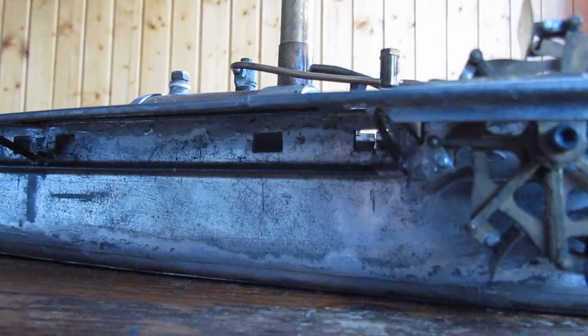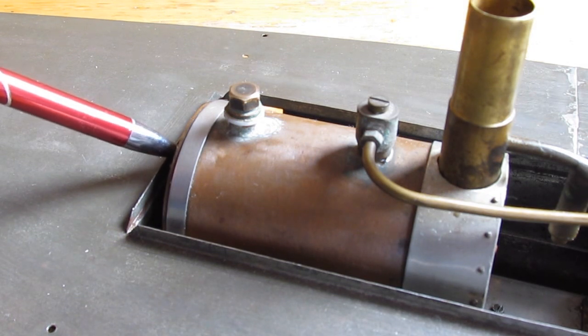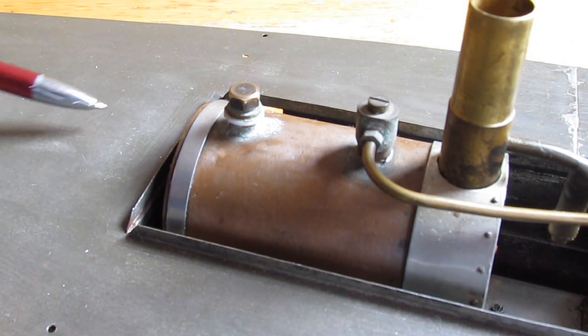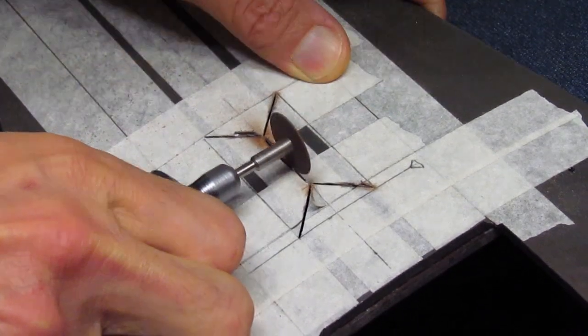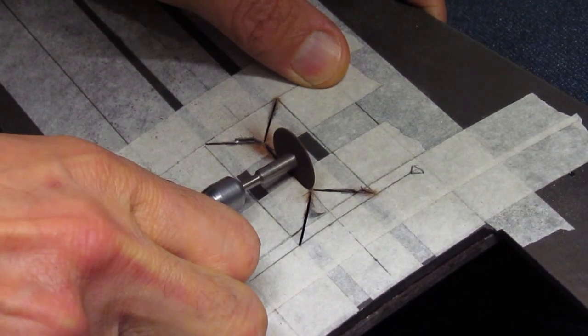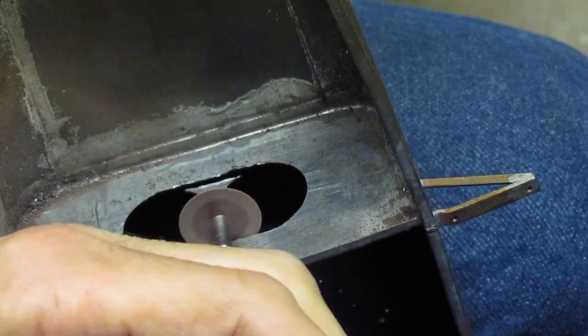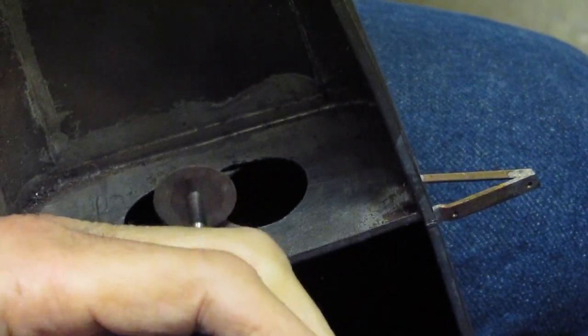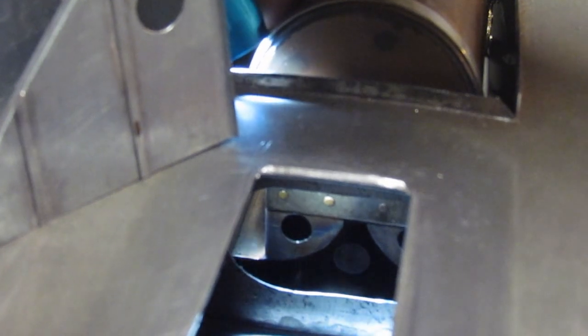These open portholes bring air to the burner. Not much will flow down from here, and it's tricky to fire up too. To improve it, I will open up the deck on the bulkhead right here. The companionway entry will then be removable. Now it can be easily lit up.